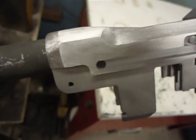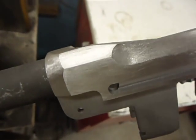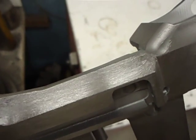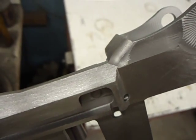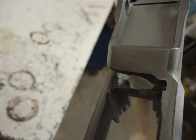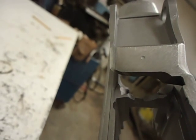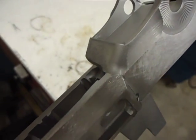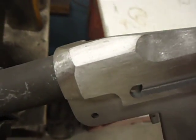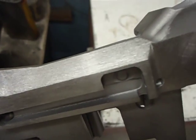We're back and this is it for the filing — we're done with the filing. We did that groove in there and it came out really, really nice. All the pits are gone. Kept all our lines nice and sharp — we didn't knock anything off. I went ahead and did the front of that piece too. I've still got the armorer's punch mark in there, but that's quite alright. It was about the only place left that had any machining marks, so it was kind of standing out. All the pits are gone.